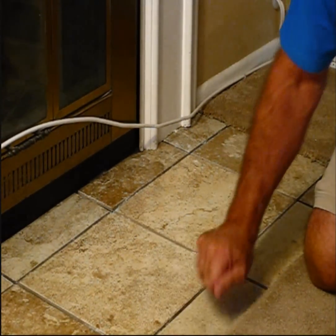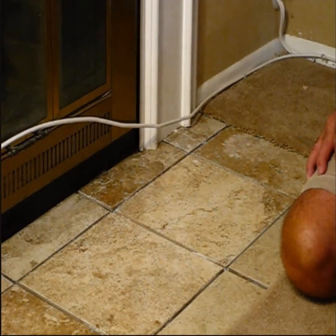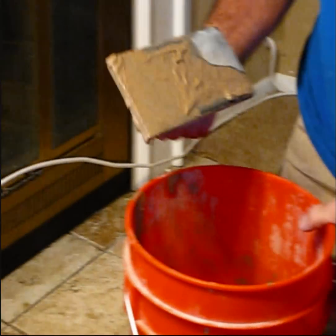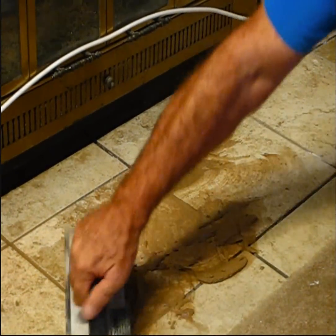After we've cleared out all the debris, the next thing to do is grout. Grout comes in all different colors, so pick the color you want, mix it with water in a bucket. Take what we call a grout float, dip it into the grout bucket, grab some mixed grout, and spread it in between the crevices of the tile. It looks messy at first, but the sponge process will clean it all out and make it look really neat. Don't do too big a section at a time — keep it manageable. Grout dries pretty quickly, so keep moving.